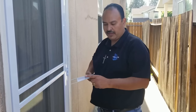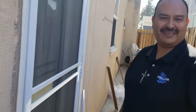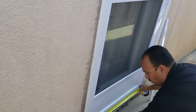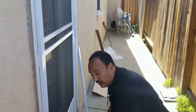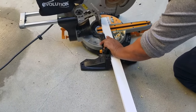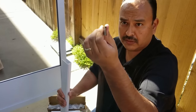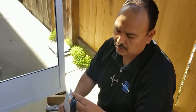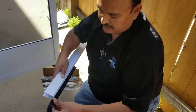It's going to go on the bottom plate and it's going to have that bug seal we talked about. It's going to attach to this, but first we're going to cut it to size. We're going to basically measure from the edge of the door to the actual other U-channel that holds the hinge. Right now I'm at a size of 33 and 3 quarters for this particular door — it's not the same on every door so you have to measure it yourself. See the bug seal at the bottom — how it has this notch in it — it looks kind of like a Y and it's going to go right into this notch. It's going to slide right in. Make sure it's straight because it could snag on the aluminum. Just take your time and ease it in.